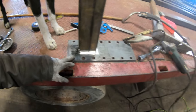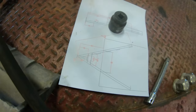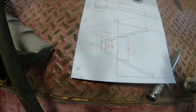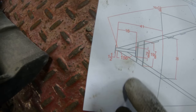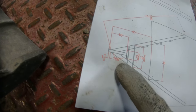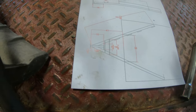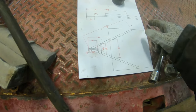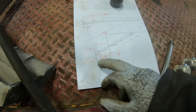We got our pintle bracket from Advantage. Basically they got a 16-inch post that everything goes off of. These are the drawings — I just whipped this up the other day, just a quick simple drawing, nothing really crazy, but something that helped keep my head straight. We're going to start by building the A-frame. We got the angle on the tube so we'll cut the tubes. We're going to leave them long and install it on site, cut them on site. They got a four-inch channel running down the side.